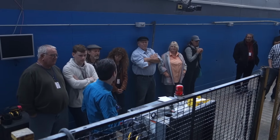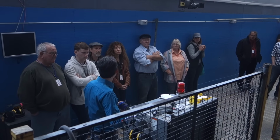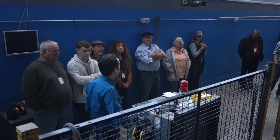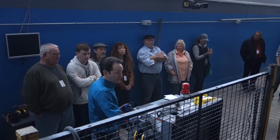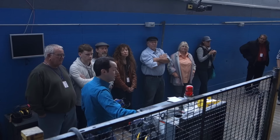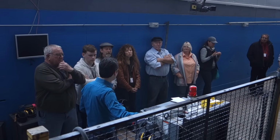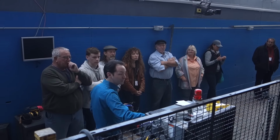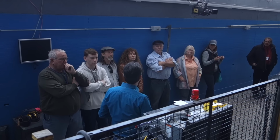A regular wall socket in your house is 120 volts at 15 amps, so you get about 1,800 watts. This is how you know the guy on Craigslist trying to sell you the 5,000 watt home theater system is lying to you. There's only 1,800 watts on the wall. Your entire house runs on 240 volts at about 100 amps. And in a moment, when we press that button, we will discharge 1,800 volts at 80,000 amps. That's 144 million watts of power. It lasts about 3 thousandths of a second, and it's a hell of a fun time.